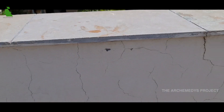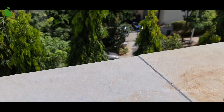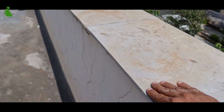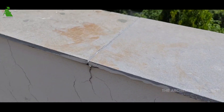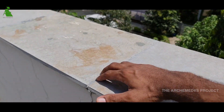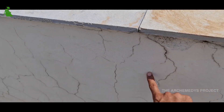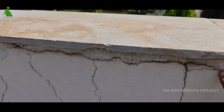The reason why these cracks come are for various reasons. When we do the overall coping on top — we call this coping — they usually use two-feet tiles, the remnant stone pieces we have. That's a general practice to avoid spending more. But what happens is when you have too many grooves, the water goes through them and gets inside. This is something a lot of people ignore. So the water seeps in and the entire wall right now is filled with water.